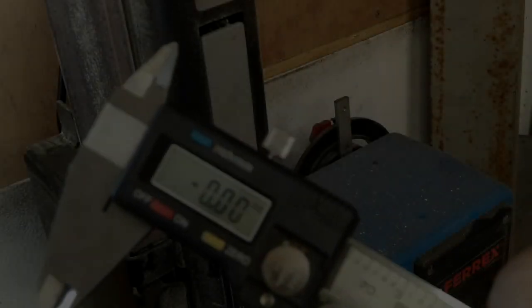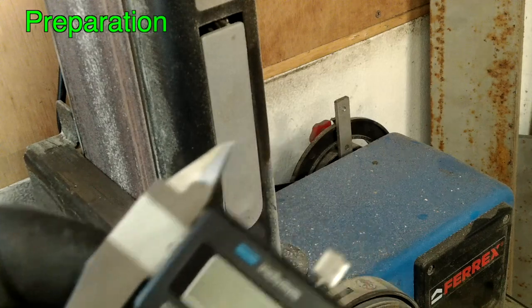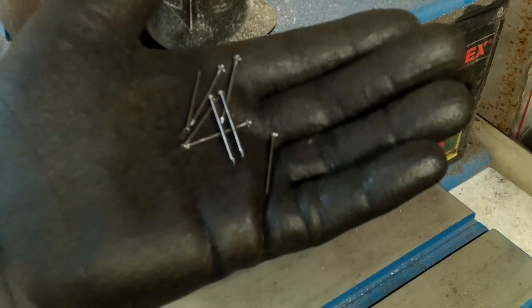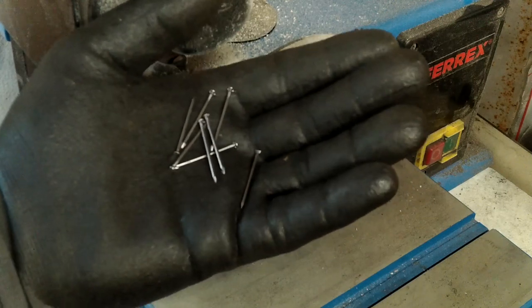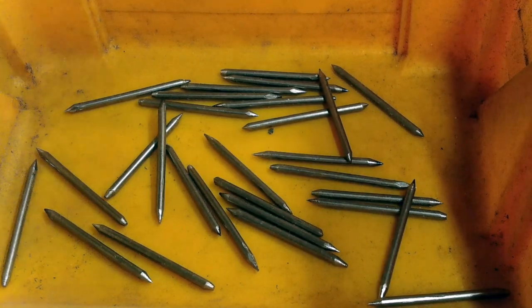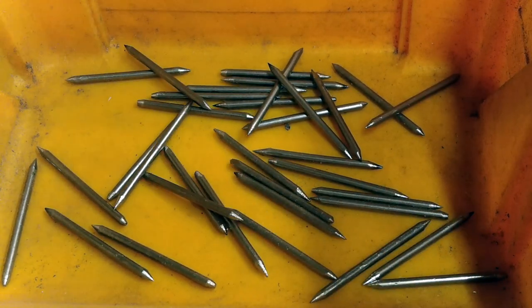True to form, I didn't buy a bunch of 1.5mm rollers. I found some in the form of round wire nails. With the heads removed and the burrs at both ends removed, you'd hardly notice. For the epoxy resin not to stick to the aluminium angle, all burrs had to be removed and then buffed.